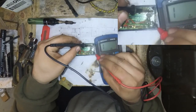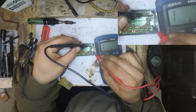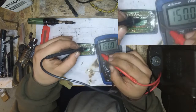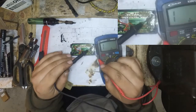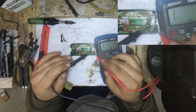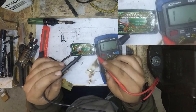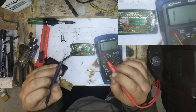So we can give it a test. If we connect those two pins, can we read anything? And we read 150 — so if we can get a connection, there we go. That resistor is good. Even though it's a bit dark and it looks like it's overheating, it probably will need replacing — and probably will need replacing with a higher wattage resistor. I have asked the gurus and I'm waiting for their reply.